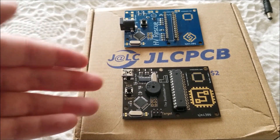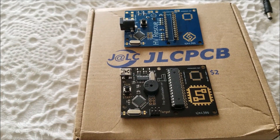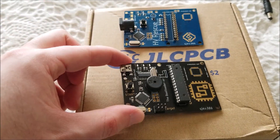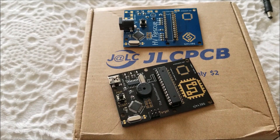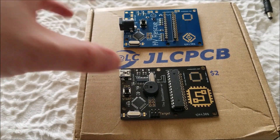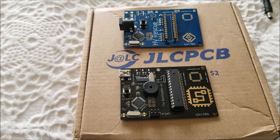These might not be super exciting, but they're going to be really useful tools for me. The HV rescue board means whenever I make a mistake I can recover it — I'm not out two-fifty for an ATmega328P. The standalone programmer will be really useful taking a project from development to production: I can do all that in-house and save time. Burning a bootloader this way takes around five seconds versus twenty to thirty seconds hooking up to a computer. I'll create a Hackaday.io page with board files for both projects so anyone can use or build their own.